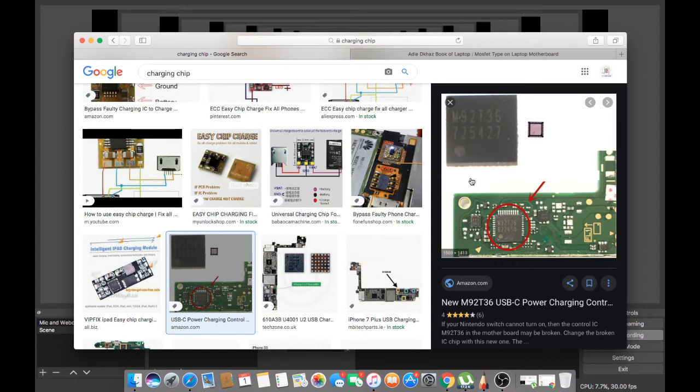As you can see, these tiny white dots stand for pin number 1. It shows you how we're gonna install the chip on the laptop motherboard. To align the pins and everything, you need to take note of this. Be careful of the white dot. It needs to align with this dot on the motherboard. See the white dot there, and the arrow here on the motherboard. These two should align. You should be very careful when you are replacing a chip. Okay, this black thing is a chip.